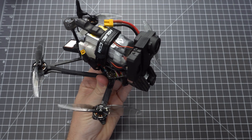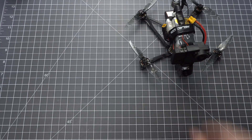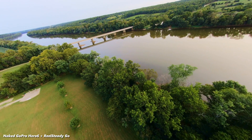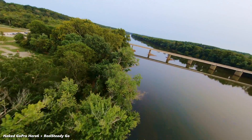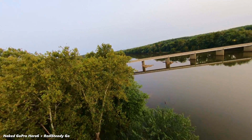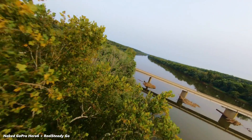Alright, let's take it for a flight. I've got the 850 mAh battery and the Gemfan Hurricane 4024 bi-blade props. So this quad is awesome — it's by far my favorite build to date. It's small, flies far, and flies forever. So far I like flying a 4S 850 mAh battery and that gets about 6 to 8 minutes.